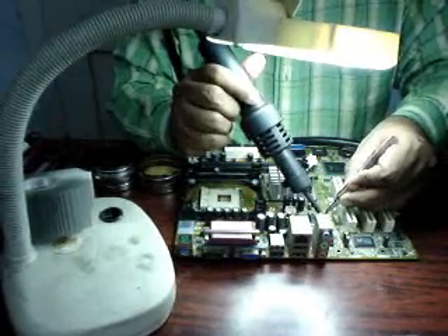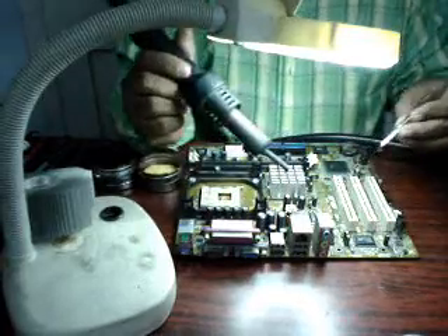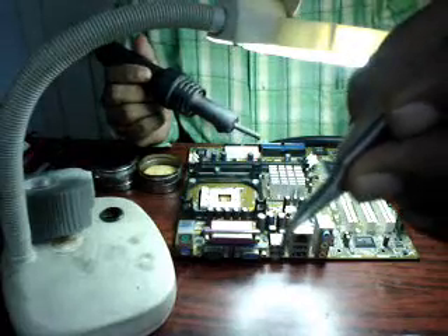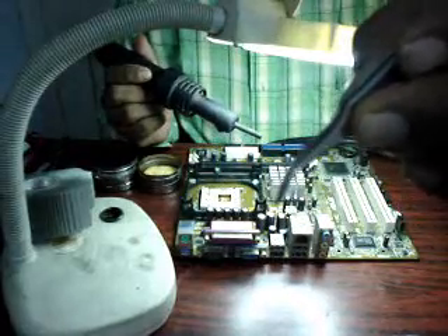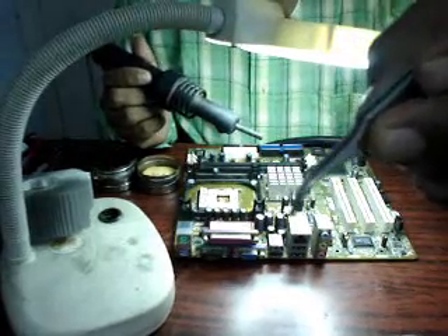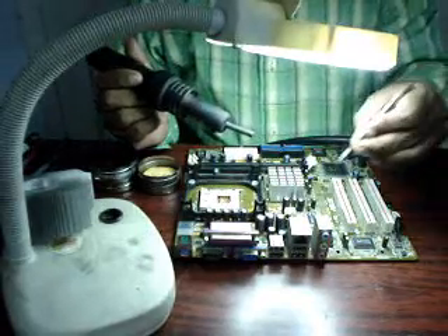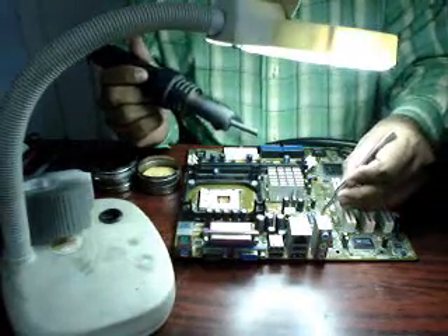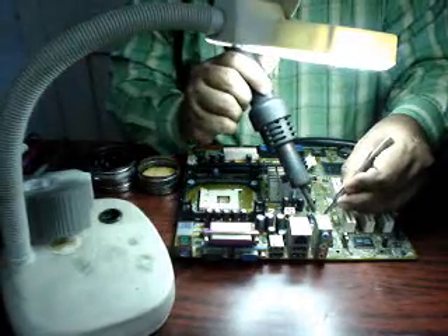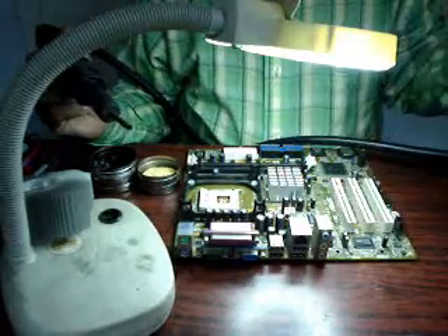I have removed a capacitor which is held in the tweezer. It's a very small, very micro device. You have to work on such devices for your day-to-day repairs. If I want to place it back, just hold it where it was, give it heat, remove your heater, and then remove your tweezers.